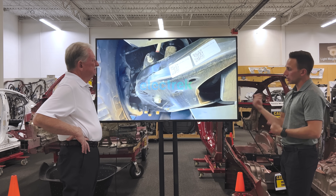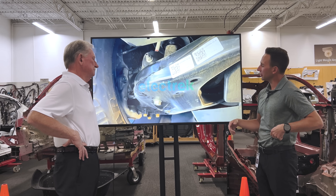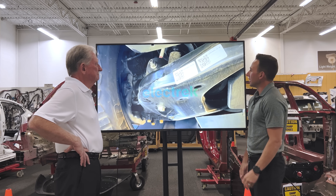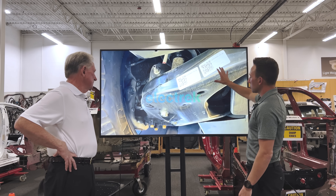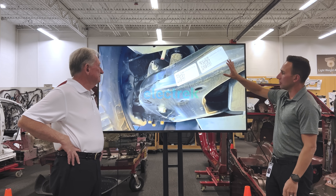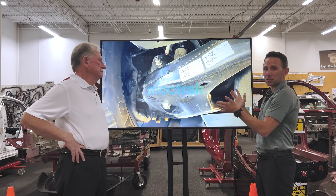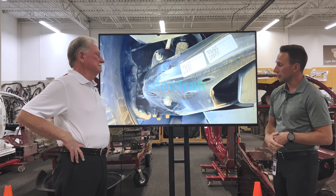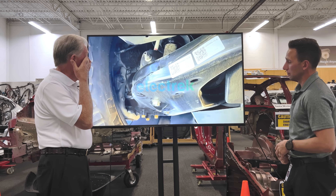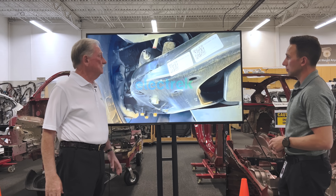The interesting thing — aluminum in the front, steel in the rear — we used to see folks do this when differentials were common in different cars, like rear wheel drive applications where they'd have an aluminum differential in the front and cast iron in the rear for better weight distribution. We've seen that applied to rear suspension systems and cradles, where if you don't have a good 50/50 weight distribution front to rear, you go to steel. But as Sandy pointed out, from a cost and mass perspective, it's actually surprising when you compare like suspension systems — the stamped steel clamshell welded strategy is among the lightest and it's definitely competitive on cost. It's usually a wash between aluminum and stamped steel, and this is a perfect application.